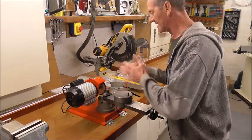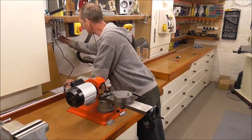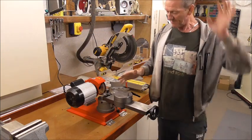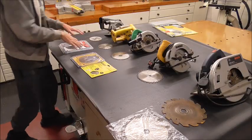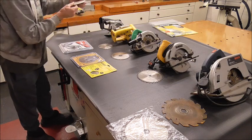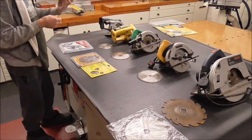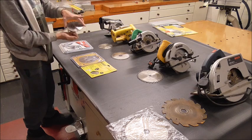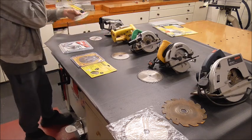Okay. So now I'm set up, and for sharpening I'll just plug this in here — I won't turn it on yet. For sharpening, I have quite an arrangement of blades. As you can see here, battery tools, small blades — what is that? 136 millimetre, 24 teeth, 10 millimetre bore. Very small bore. Same with that one — 10 mil bore.